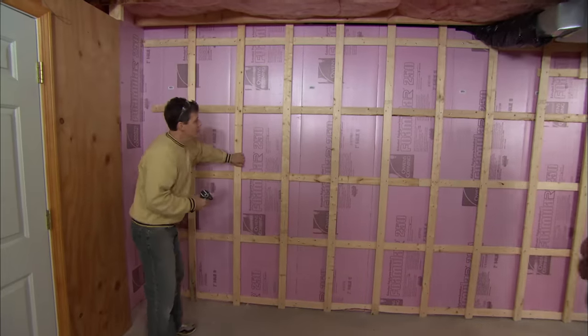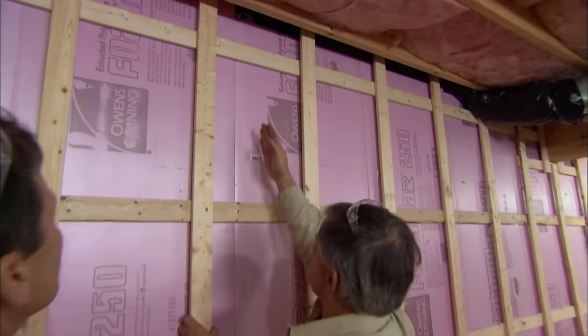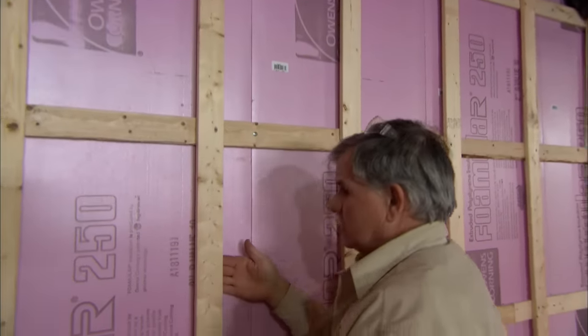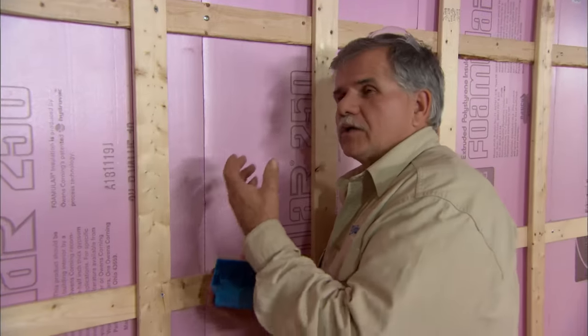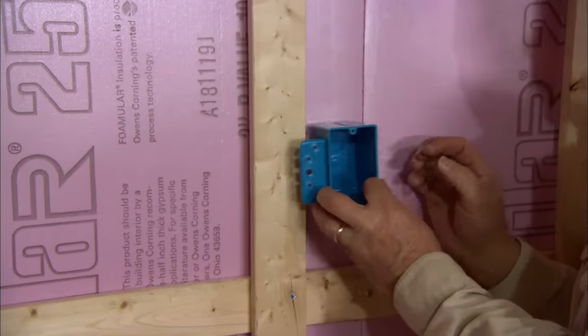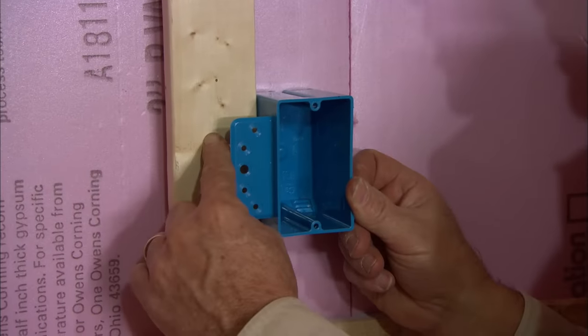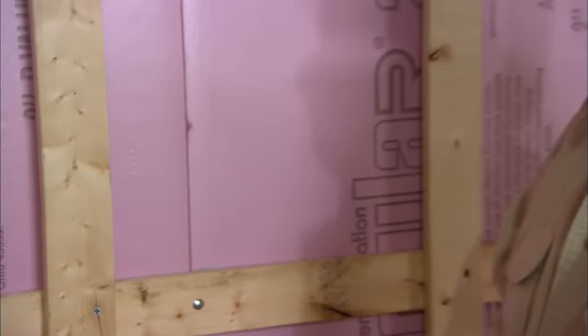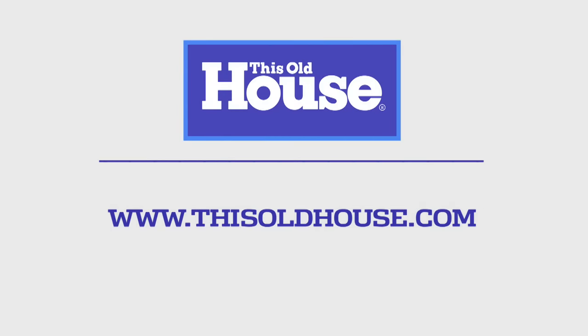This looks excellent. Now we have two chasers — we can run a wire down from the ceiling vertically or horizontally behind the uprights. By building the wall out, we've also created more depth so we can use a standard electrical outlet. If we want to mount one, we dig out a little bit of insulation and put it in up against the one-by. This is fantastic — I'm going to get my brother in here this weekend to help me finish it off. Good luck. Thank you very much.